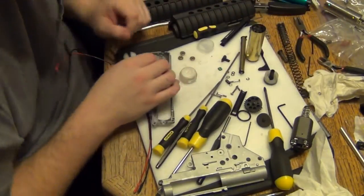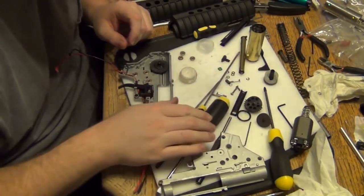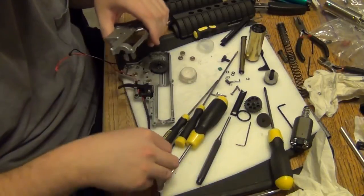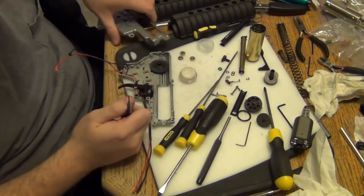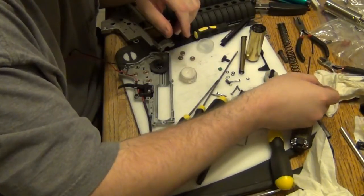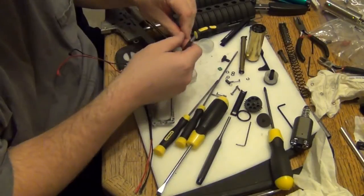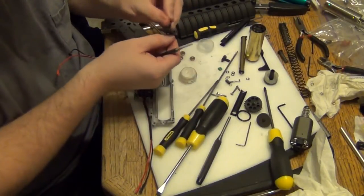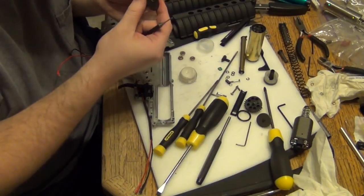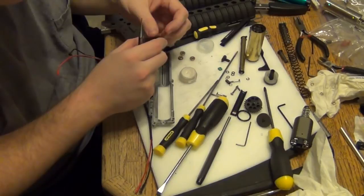So it's rubbing on the bushing or bearing and the gearbox, and you basically have this grease circle inside the gearbox that looks like crap. It just lets you know that it's not running as free-flowing as it should be. So what you need to do is put a shim or two to push it upwards from this location, and you can spin it with your hand to see how well it spins. But at the same time, you need to put shims on top, depending on if it can move up or down while the gearbox is closed.